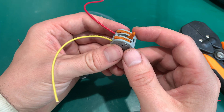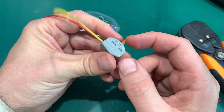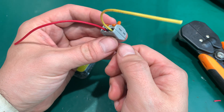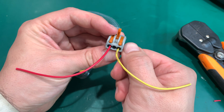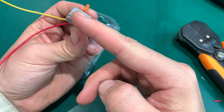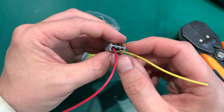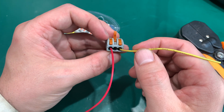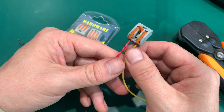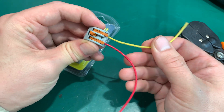I'm saying that there are models that do not have this latch and you just insert the wire. I've had a problem because if you put one big wire and one smaller wire, some kind of tub inside was uneven and there was no tension for the smaller wire. I do not recommend those — I've had a fire hazard with them. But this one is absolutely perfect.